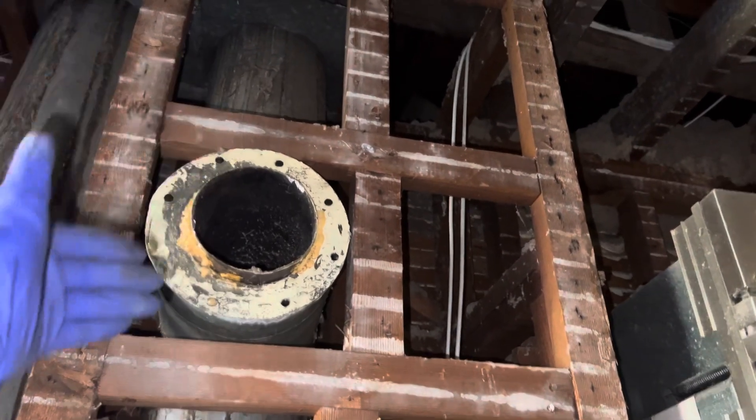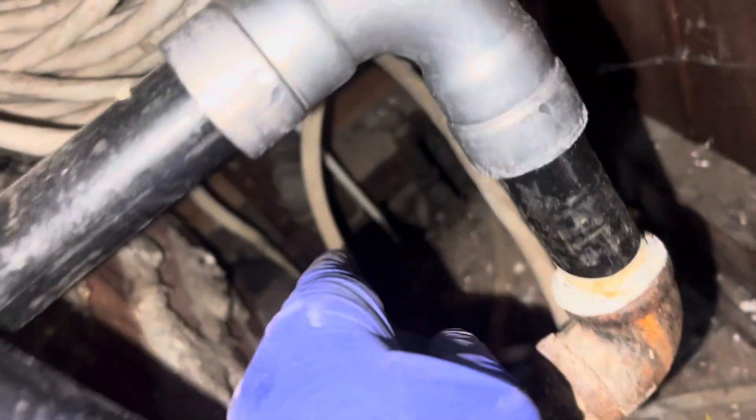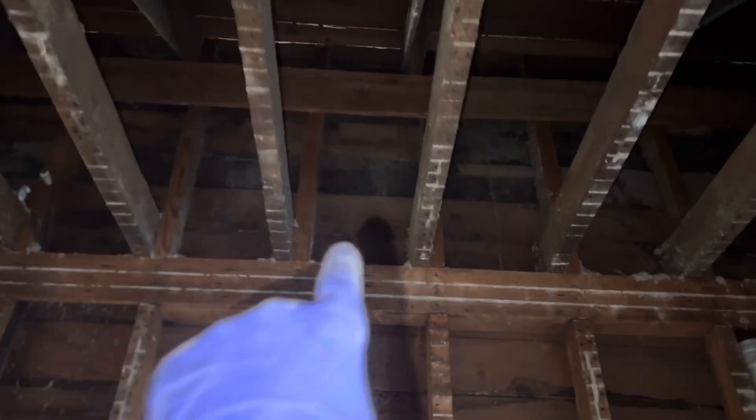When I perform this test, I'm going to leave this opening for the hood for the stove because there was no back damper or anything originally. I'm going to test it as-is without closing off, and probably do a second test with it closed off, because the new hood going here will have a back draft damper in it. This opening goes to the second floor - you can see there's a little opening and there was a leaky door that would have allowed air to leak into this area going down through the first floor all the way into the basement. There are no vents in the attic - it's a sealed attic. All the leakage is going to happen right there. That's tar paper on the other side.